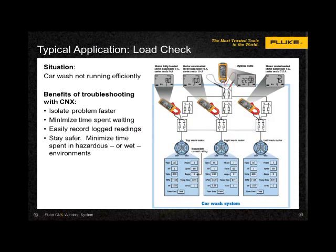An automatic car wash system motor was tripping the breakers, causing the brushes to stop, resulting in dirty cars and unhappy customers. Test results showed that the right wash motor was the culprit, causing an overload with a consumption of 10 amps. With the motor nameplate identifying only 8 amps, this became a major issue. Soon, the system was up and running again — customers were happy, cars were clean.